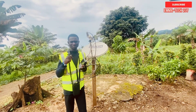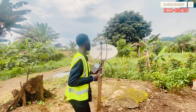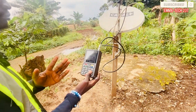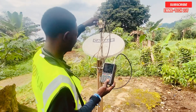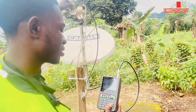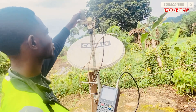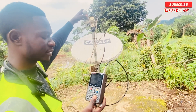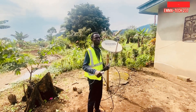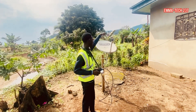The shortest distance between them is 27 degrees, so track your 27 and you're going to get it. The signal here is at 10 to 13, so try to adjust the LNB and see if you can get a signal. You can see tracking here, but it's not yet showing on the decoder — try to make all possible adjustments.